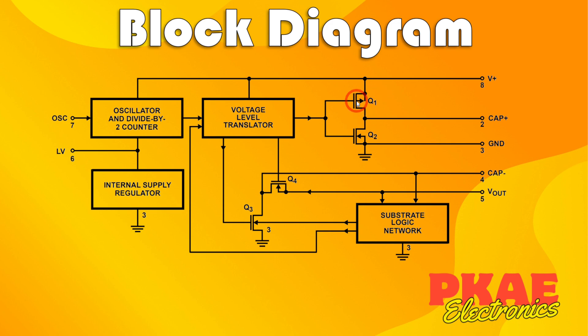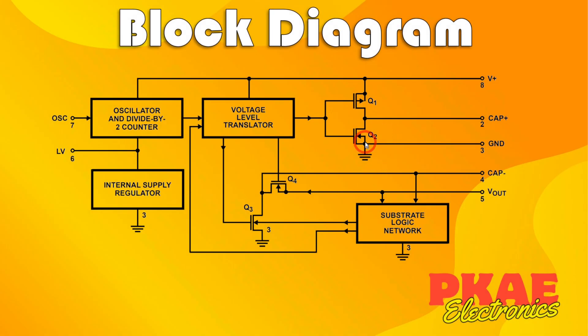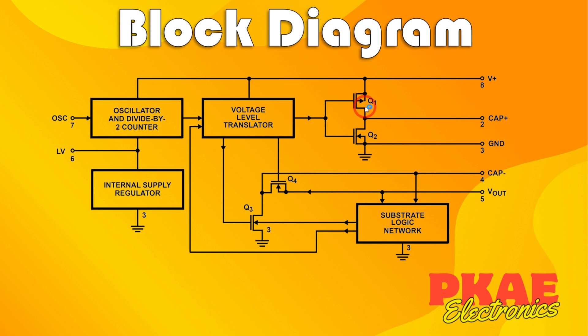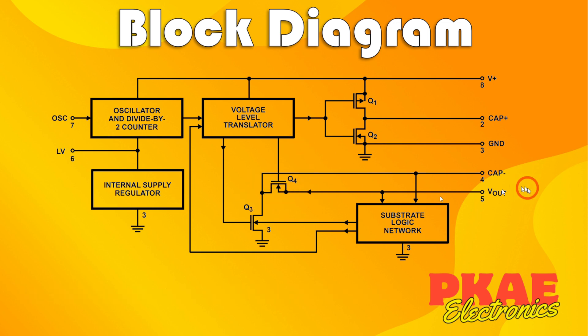There are your four transistors — these are MOSFETs. Q1 and Q3 correspond to those two switches, and Q2 and Q4 to the other two. Q1 is a P-channel MOSFET; all the rest are N-channel MOSFETs. This is where the internal clock is generated, or you can connect your own clock on pin 7. Note it's a divide-by-two, so we'll see that on the scope later. There's also an internal supply regulator which you can override with the LV pin.